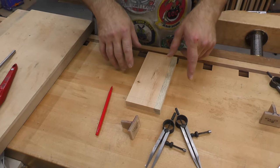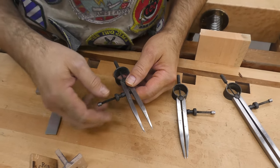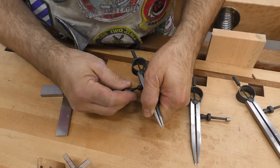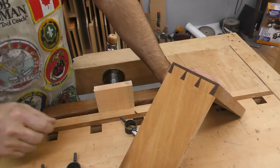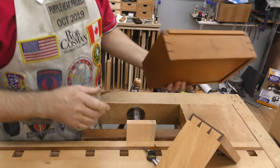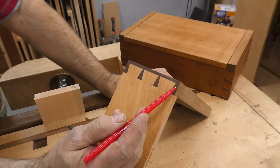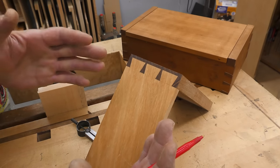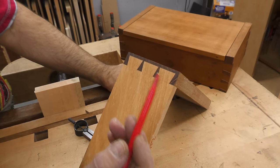Next I'm going to talk about using the dividers and the Alan Peters method. As far as dividers go, I like the ones that stay put. There are friction fit ones and they're just too easy to move accidentally. These ones stay where you set them, and it's nice if they have that speed nut which allows you to make a macro adjustment quickly and then do your final fine adjustment. But before we even start that, let's talk about the actual proportions. I like to see - we call these half pins - these are on the outside, and these are the interior pins. I always like to have the outside half pins bigger than the interior pins. There's nothing supporting that side of it, so it's all by itself. I try to get it to project the impression of strength without being overbearing. If you make them a little bit too big, they automatically go from looking right to looking out of balance.